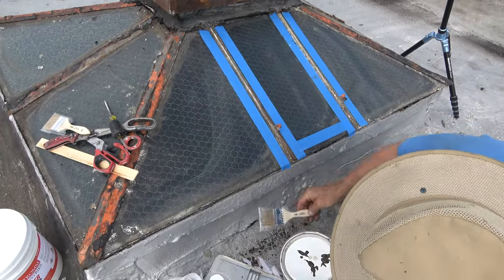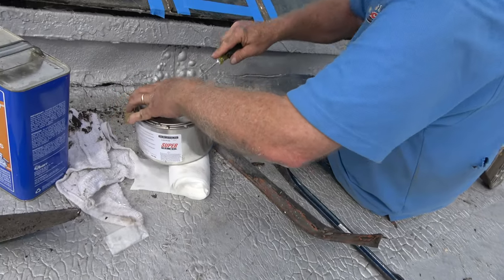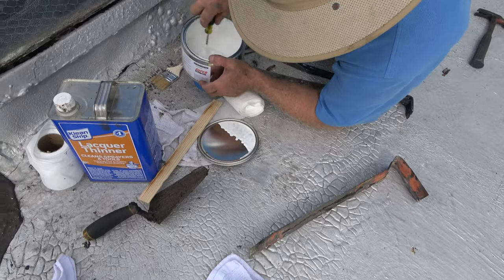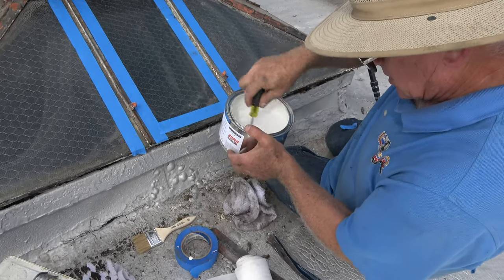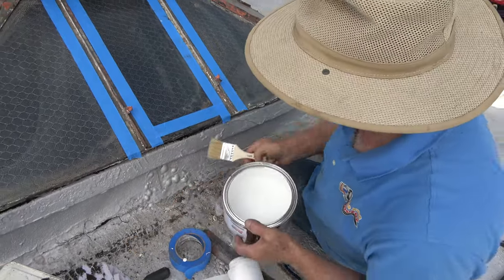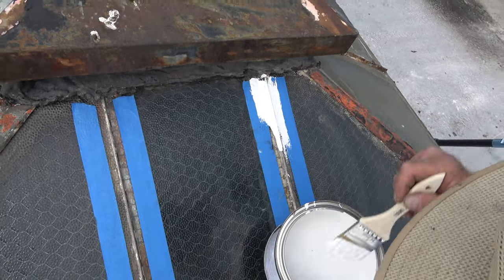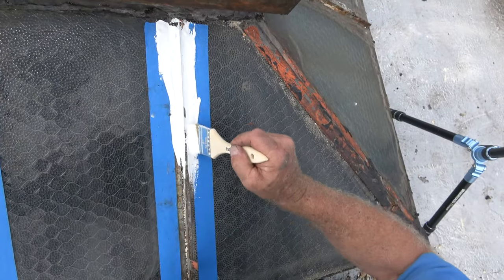I use simple silicone seal — open this can. I'm going to mix this stuff up a little bit; it got gunged up a little bit. It gets hard inside if you leave it — it doesn't have a long shelf life. Mix it up a little bit. This is what I suggest: put it right there and that is it. It will seal the skylight — the glass to the frame. See the metal frame? There's a metal frame there, and it will attach the glass to the metal frame and you'll never have to worry about a leak again.